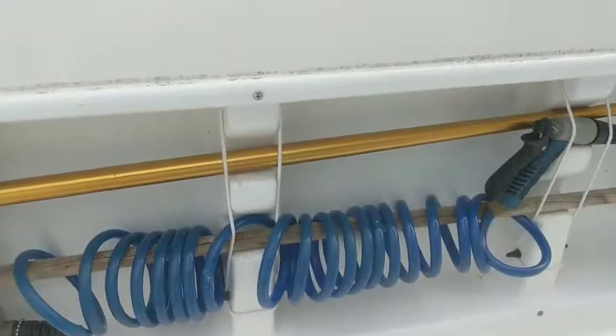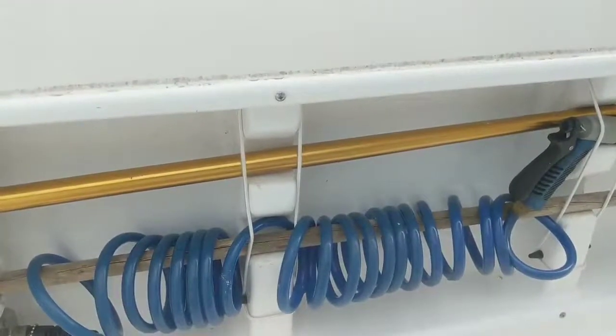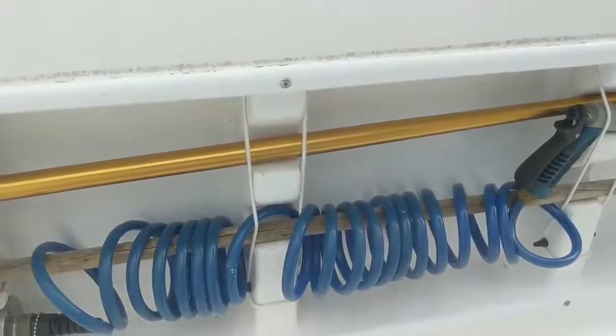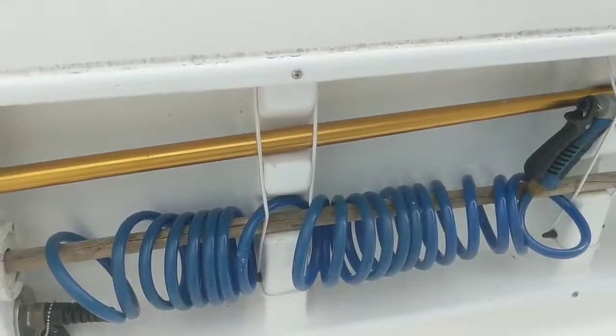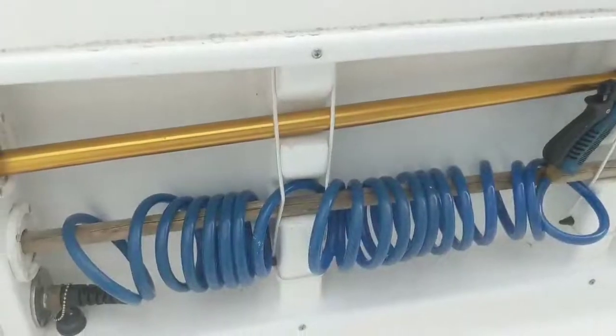When you're putting a new bungee in, the other one's still there after you cut it off, but you can work by it. It'll work right past it if you have a little bit of patience. That's why I used the 3/16 bungee instead of the quarter. I didn't have to ream the holes out, and I think it'll be just as good. It's a marine grade bungee.